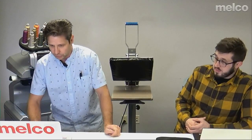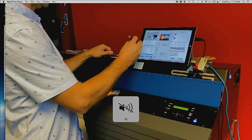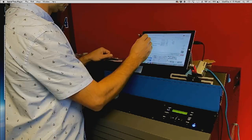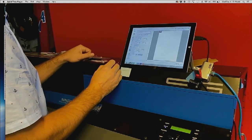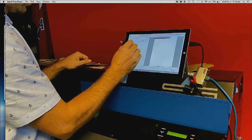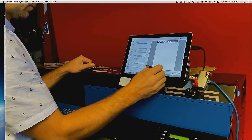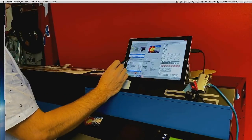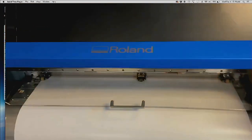Let's go to a video and show you how this is done on the solvent printer — I'll narrate over it. Right now I'm in what's called VersaWorks Studio — it's a very simple platform from Roland. This is where you bring your artwork in; it's basically a RIP. I can bring the artwork in saved as that EPS from Illustrator, tell it how many I want to print, filling up the sheet of the roll of media which is 30 inches wide, and choosing what media I'm putting it on — which is HTM3 heat transfer material. It takes just a minute to spool and calculate.